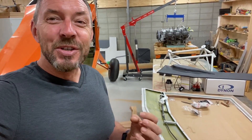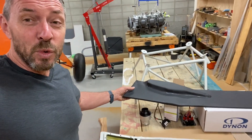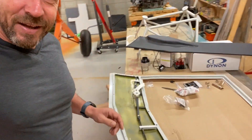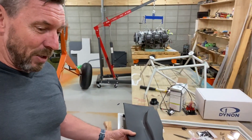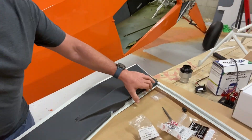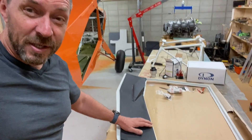I've done a lot of work on the aircraft doors in the last month. This was a modification and quite clearly any modification results in a lot of extra work. What I've been doing is making up these interior panels for the doors out of Kydex — this one has turned out pretty well but it's the third iteration of this panel. I've drilled holes all the way around the door frame and I'm using nutserts. I broke the mandrel for the nutsert riveting tool two days ago, so I haven't been able to finish it off. The panel sits quite nicely over the interior of the door. I'm holding it in place with small black machine screws into the nutserts.